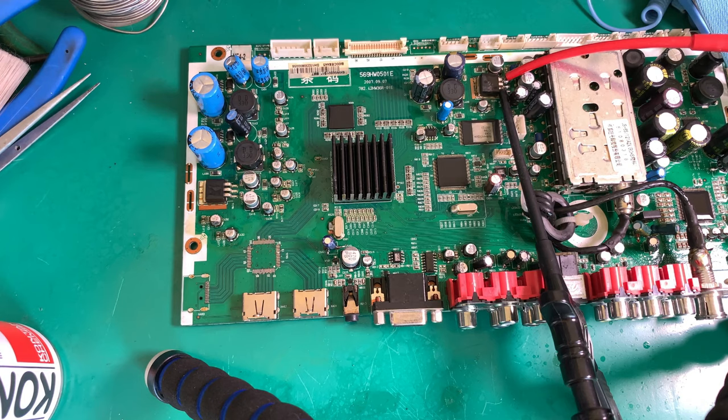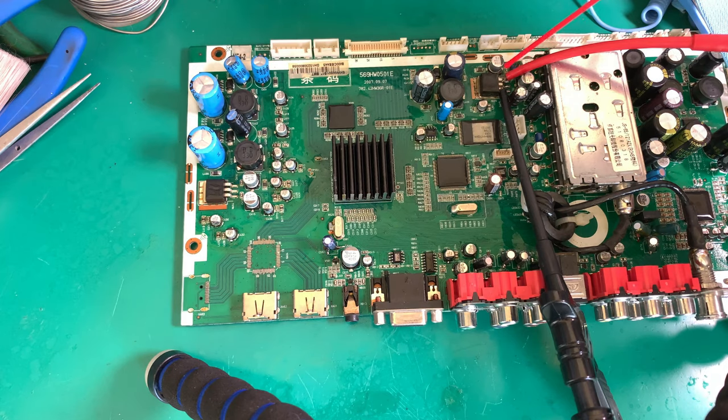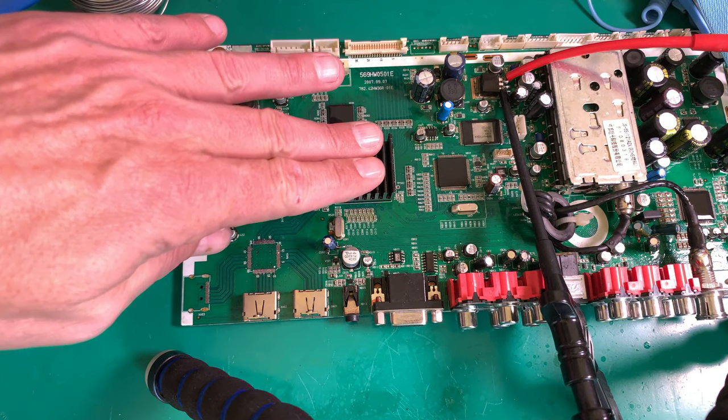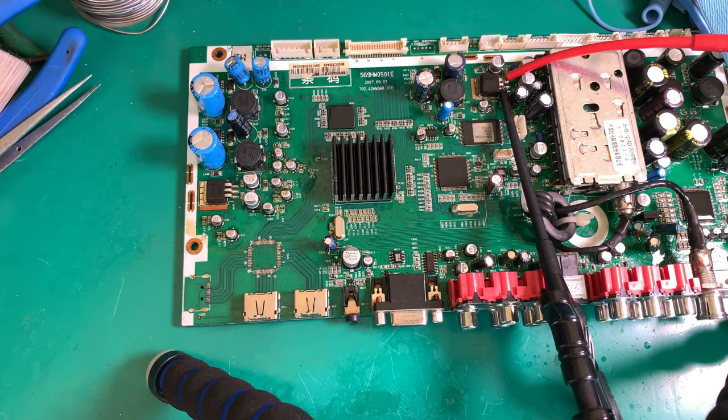And what we can see, we just look up there again. I'm just going to spray that one, the low dropout regulator. Slowly, what you'll see is it starts evaporating. It's not hot to the touch. The thing that's getting warm is this heat sink on this video processing unit. I expect that. That's not the end of the world. Nothing seems to be evaporating very quickly, because that's what you would see if the component was shorted. You would see this stuff start evaporating rather quickly.